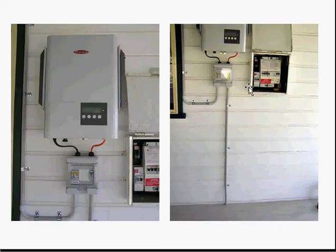Now it shows that we couldn't take the cable straight from the DC-AC switchboard to the meter box, because it was set into the wall and was too far back, so we had to actually come down underground and come up through the wall into the back of the meter box. This is the cable coming down from the roof, and it brings the DC power down into the breaker box.